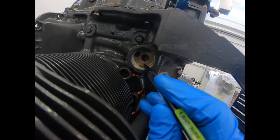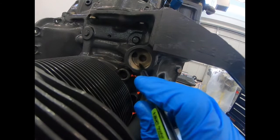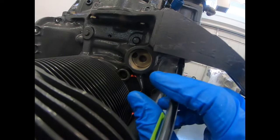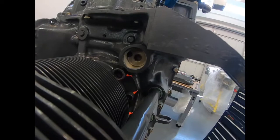Occasionally if you have an oil pressure problem — for example, your oil pressure wildly changes with RPM, increasing and decreasing so you can almost use the oil pressure as a tach — what often happens is contaminants get trapped between the seat and the ball, causing the valve to stay open. Then your pressures change based on engine RPM. That's the oil pressure relief valve.